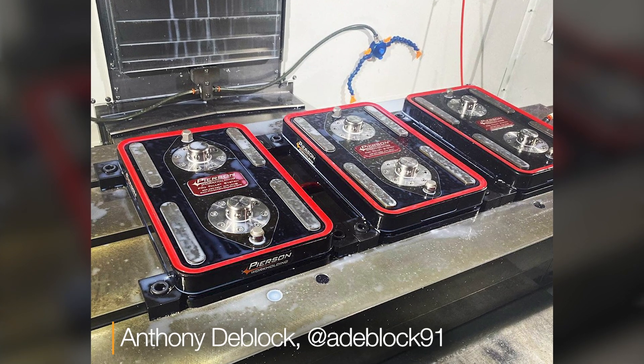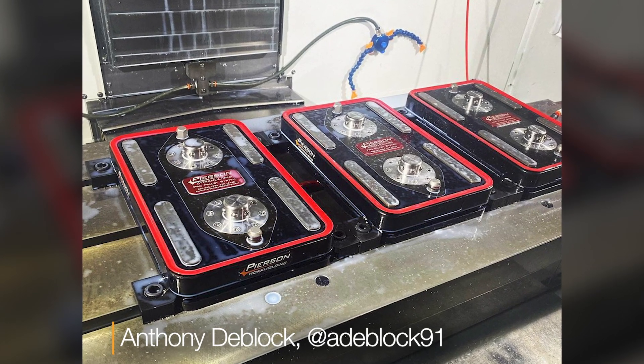Finally, one of the most creative things we've seen — we don't do this, but one of our customers dedicates a pallet to hold the tool presetter. The tool presetter is typically just held on the table and you don't move it, but what they've done is mount it to a corner and probe their tools with it. This particular customer has a VF2, which has a cutting window of 16 inches in Y and 30 in X. They've standardized their table with three pro pallet bases and three 10 by 16 inch pallets, giving them 100% coverage of the machine table. When they need to probe their tools, they just take off one of the pallets, put the presetter pallet on, and it's all set up.